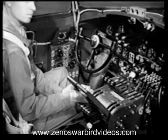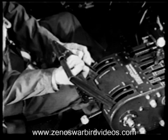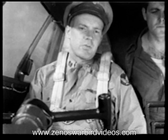Now we're going to crack them so we'll get about 1,000 RPM from our engines when they start. How far will that be? Oh, have to guess, but I'd say about 3/4 of an inch open. Move the inboards up past the outboards about that far. Now bring the outboards up even with the inboards. That's the easiest way to judge the distance. They'll probably need some adjustments when the tach gets going and we can tell more accurately.